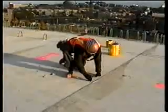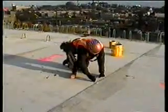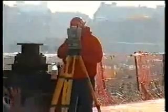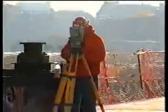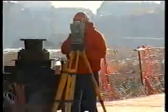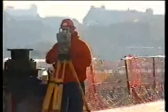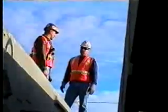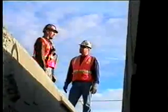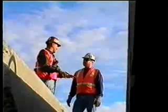Here's a shot of Bobby Manzi, the engineer, checking the stone alignment to see if it's right on line and if the elevation is correct. And his partner Mark McManus is reading the transit, giving him the information — tells us what we have to do with this segment: up and down, back and forth, put it in the right place. Murray Smith and Jimmy O'Donnell, the foreman, are discussing the job. There's the general foreman — everybody's in charge up here.